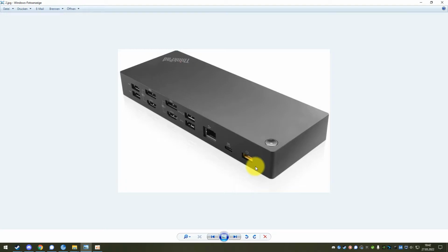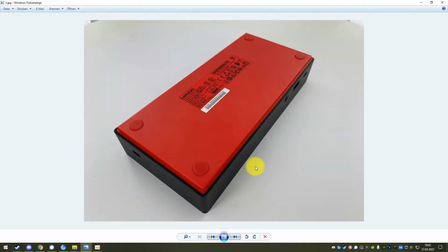First thing, of course, you have to do when you want to take this apart is find out where to get in. So you turn it around, and on the back side you see no screws at first, but there are these rubber feet, and also there is the sticker. Here I marked the location of in total 5 screws, so 4 under each of these bumpers, and 1 is hidden under the label here. When you run over that with your finger, you can feel the little indentation. There is the screw under there. These are all Phillips head, however it's 3 different types, so make sure to remember which screw goes where when you put that thing back together.